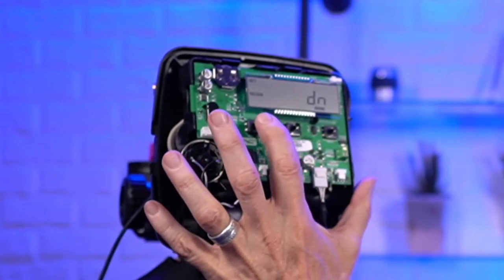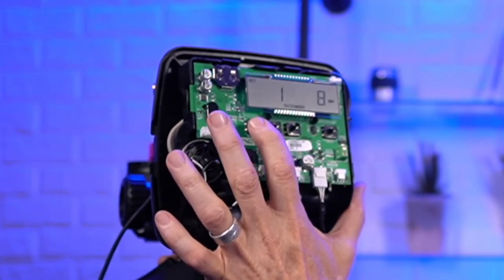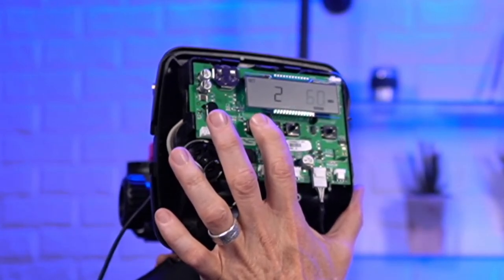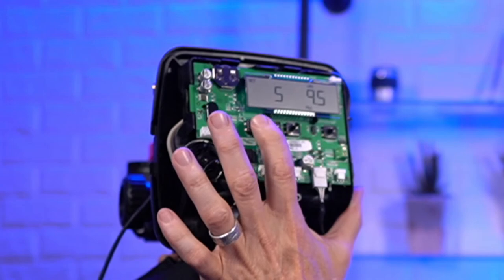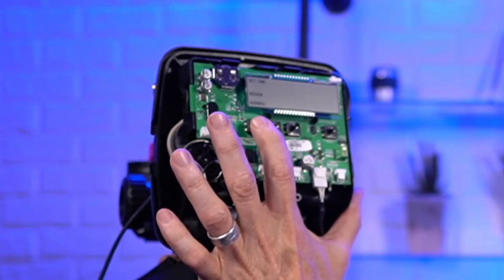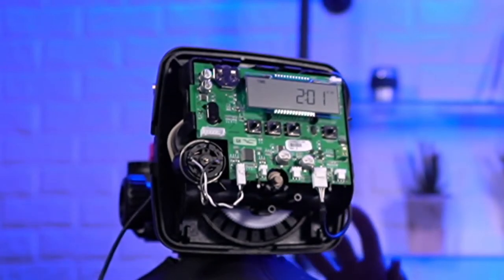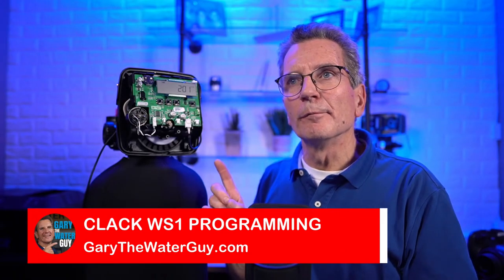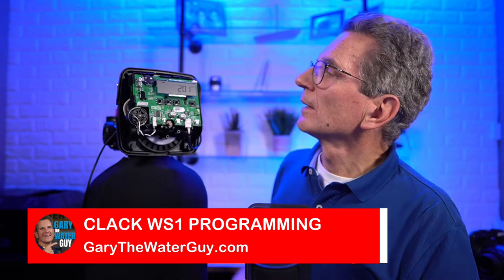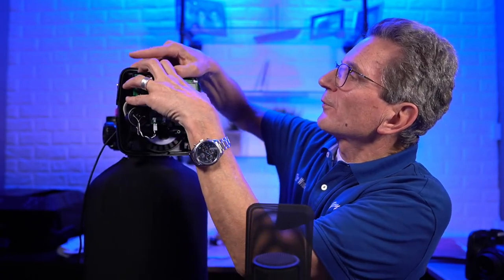All right, so next. And so down brine. Then post fill. So it's putting water in at the end of the cycles, and then it goes through the times and the cycles. So again, it doesn't allow you to change the cycles, etc. 9.5 pounds of salt, 24,000 grains, automatic, normal regen, and the relay is off. So this can be, again, used in a number of different ways. It's not a valve that, like I say, we very seldom use. It's called the EI, I believe, the four button valve. So that's that one. And then let's move on to the three button valve.